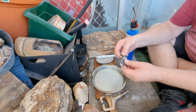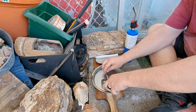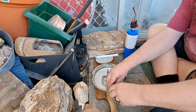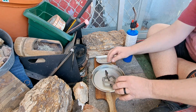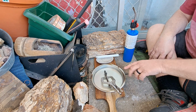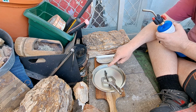But what I do to stop the strike face from getting soft is I place it in some water. I've got a little C-clamp, and just put it in there so that it sits all even, so that it'll get all there where I want it to soften up. But the strike plate is actually in the water, because the heat will not go down into the water.